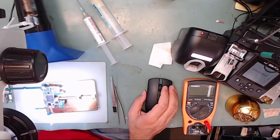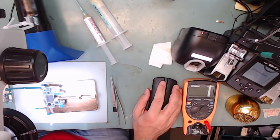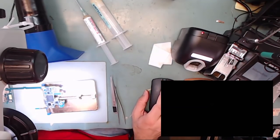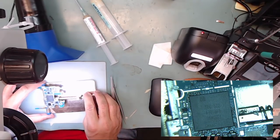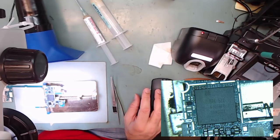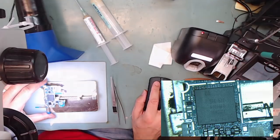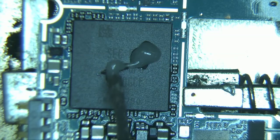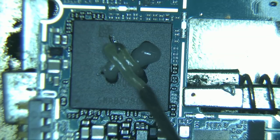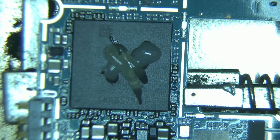This phone has a double-stack processor IC chip, which means that there are two separate processor IC chips installed on top of each other. We have determined that due to insufficient cooling, a design flaw by LG, over a period of time, the processors are overclocked and the upper IC processor chip starts to deteriorate and cause the phone to boot loop or get stuck on the LG logo. In some instances, this is due to the connections beneath the IC chip. In other instances, long-term heat just wears out the chip.